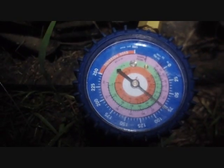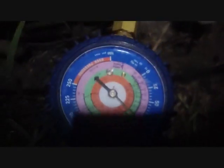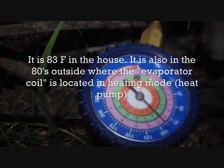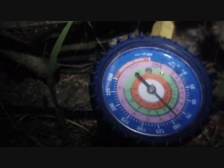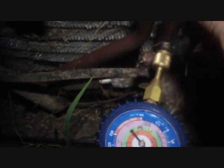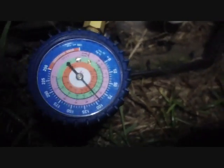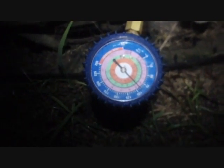We're running in heat, bypassing the TXV, and we have normal operation. Suction pressure is going up a little bit — it is a little warm in the house, so suction pressure would be a little higher. We're over 80 degrees in the house — actually about 85 — so we're rocking and rolling with our temperatures. Hot gas inside, going back out through the compressor. We're going to shut it down and change the TXV.